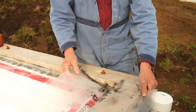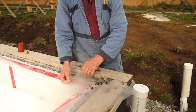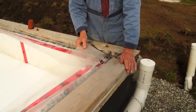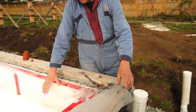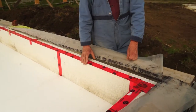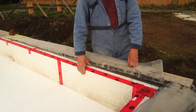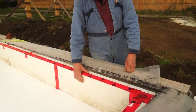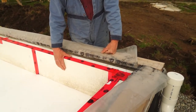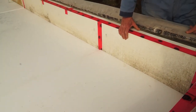The second sheet will be underneath the concrete, which will be the floor surface in this house. On the interior of this house's foundation, I have put two layers of two-inch foam to give a total of four inches of foam. That foam reaches from the top of the concrete wall all the way to the footing to prevent heat loss to the soil.